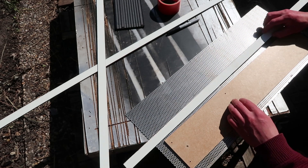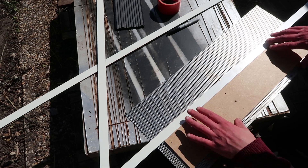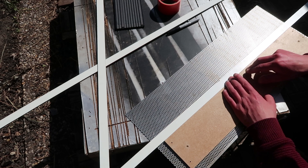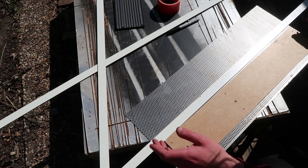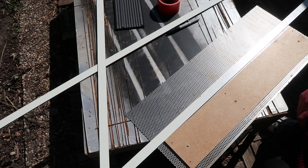In this case the imperfections will be on the outside, so on the non-crucial side. The inner part of the panel will be accurate every time, except the outside might change by half a millimeter or something, which doesn't really matter — it's the inside that counts. I could use the CNC machine for more accuracy, but I think it's a waste to do these long cuts with a CNC and screw up your cutters, which are far more expensive than the material. So I just use a normal saw.